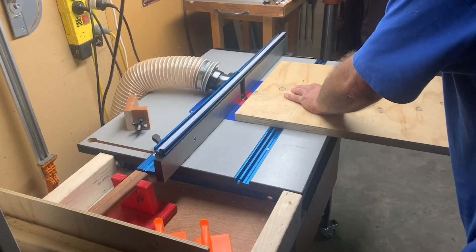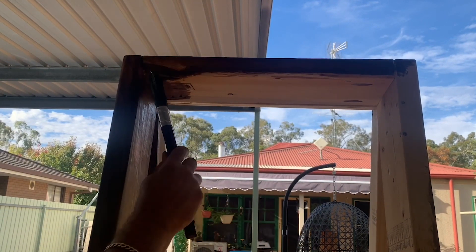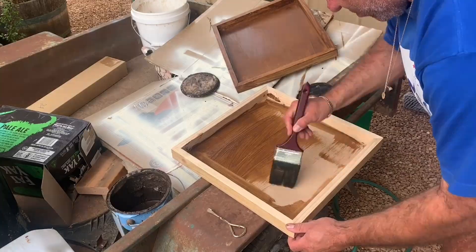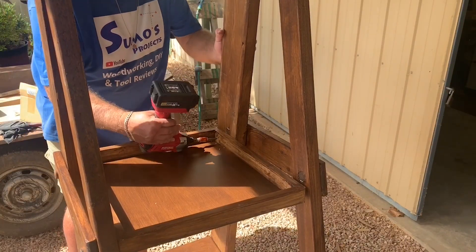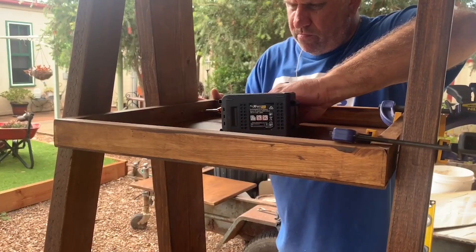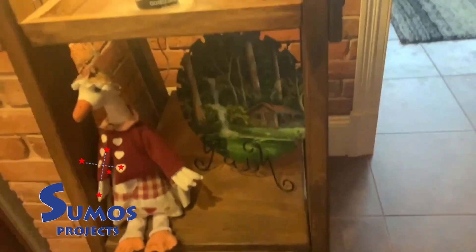This is the bottom shelf — it's going to be an extra tier on this. Just a bit of a clean-up cut, cut it to size, and now we commence putting a finish on. This is a walnut finish and it looks pretty good. I'm applying three coats, putting it on quite liberally. It takes away the look of natural pine and gives it the feel of a hardwood finish, so it comes up really nicely. Getting the levels right and then using screws to join the display shelves. I'm pretty happy with the whole build. Thank you for watching, make sure you subscribe to Carbatec and enjoy all the other great videos from the makers — thank you very much and I'll see you next time.